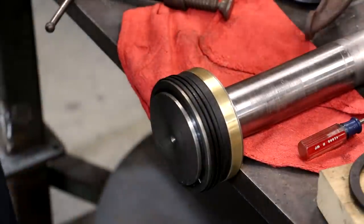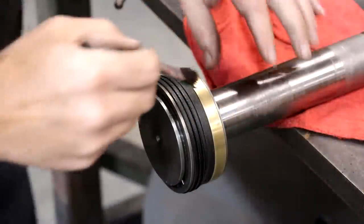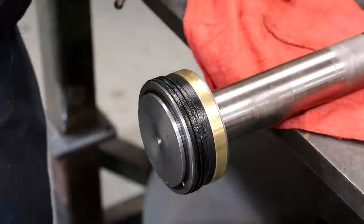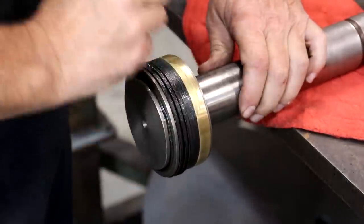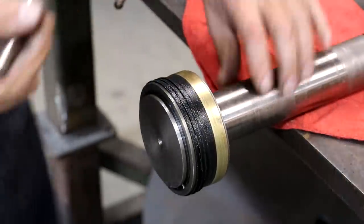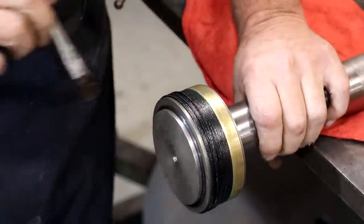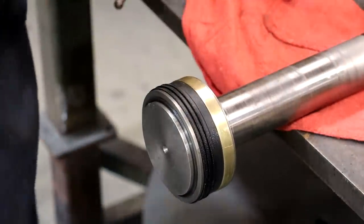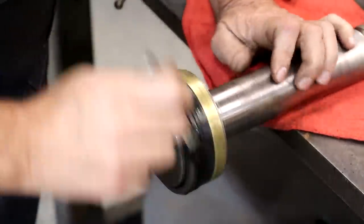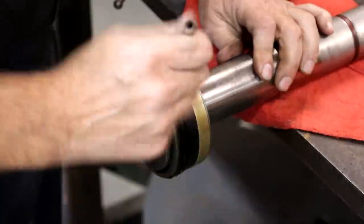I think we got it together and it's ready to go back into the cylinder. We're going to put a little grease on this just to give it some lube to go back together. Most videos I've seen on hydraulic cylinders recommend putting grease on the glands or seals — it helps prevent damage as they go together and helps them slide. Of course this is going to be running in hydraulic oil once it's all together, so a little petroleum-based grease in there should be fine.